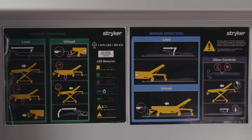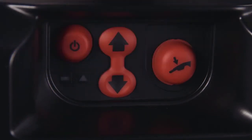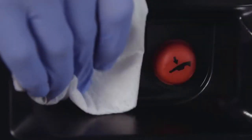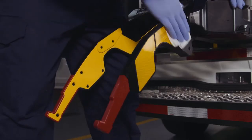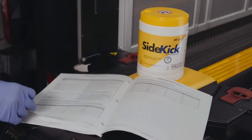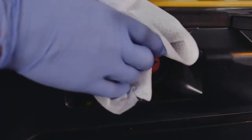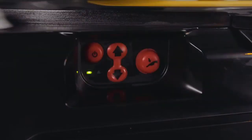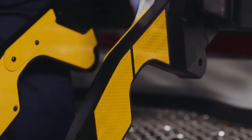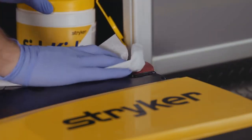Power Load operation labels are available as a quick reference guide to be placed on the inside of the rear doors of the emergency transport vehicle. Make sure to press the Power Load master on/off switch to the off position, and the master vehicle power should also be off before service or cleaning. Power Load is power washable; don't spray directly underneath the trolley up into the trolley mechanism. Stryker recommends using the suggested cleaners listed in the operations and maintenance manual, as some cleaning products may be corrosive and may cause damage to the product. The operations and maintenance manual also has information to help you establish a preventative maintenance schedule, including checklists for operators, and you can adjust the routine maintenance schedule to your actual service usage.